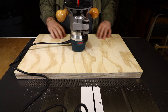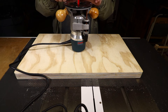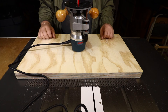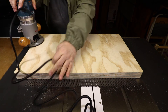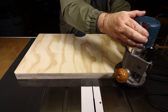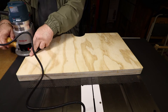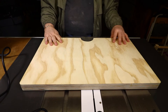I'm going to trim the sides of this top. The boards are glued together and I have a flush trim bit in my router — it's a half-inch diameter with a half-inch shank for better stability. I've got it set to the depth to cut to the edge I want, and the length of the cutting blades is one inch — a perfect fit for three-quarter material. I'll go around and get it flushed up and trimmed. Sure to keep the cord out of your way so you don't cut into it. Got it trimmed up flush all the way around — good and smooth, a little bit of sanding and it's ready to go.